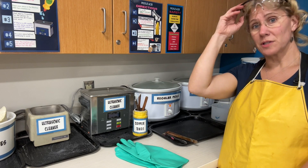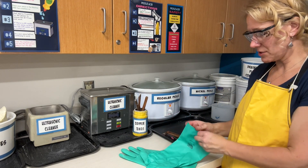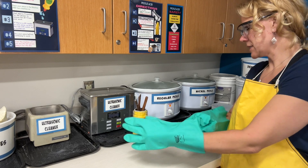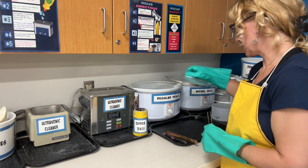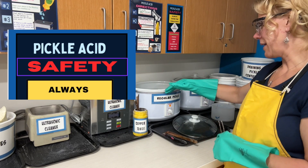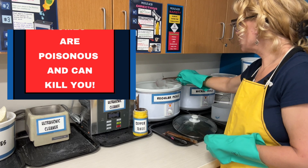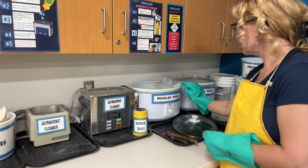So it's been 10 minutes. I'm going to put my safety glasses back on — again, that PPE we want to put on — I have to put on my gloves. I'm going to take copper tongs to get my piece out of the pickle. I'm going to take the lid off. Make sure that you're staying away from it — notice how I'm not putting my head over the top of the pickle container. I'm going to let the water drain out of it and pour a little bit out as well.